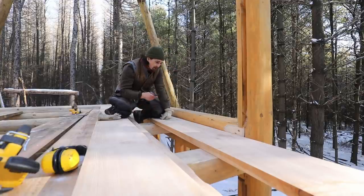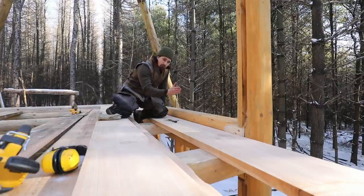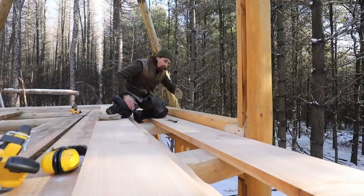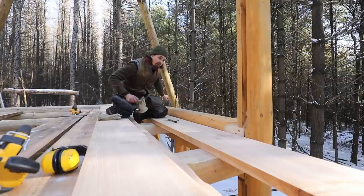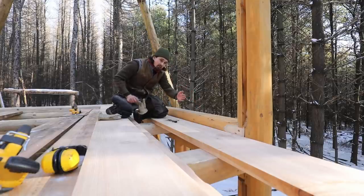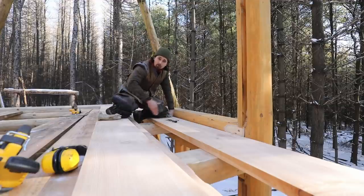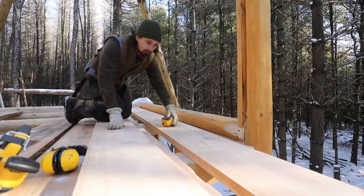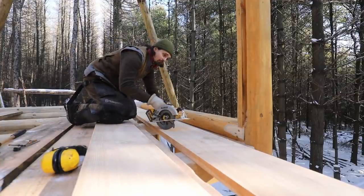It's probably a little difficult to see from this camera angle, but in order to get my floorboards all going square, I need to do a bit of scribing on this first floorboard because this top plate angles slightly out — I want all the water that drips off the front to drip off the cabin. So I've got it pushed out at an angle, but then I needed it centered with this post. This first floorboard is going to get scribed, so it'll be a little thinner in the front than in the back, in order to make this edge of the floorboard perpendicular with my floor joists, allowing me to make the rest of the floorboards all nice and square. Like most things I do, it's just wood chip by wood chip, a little bit of sawdust at a time, and slowly make it all fit.